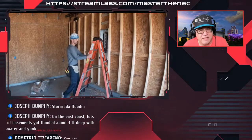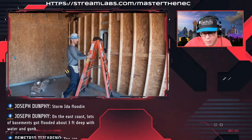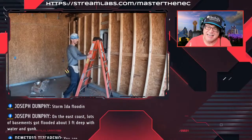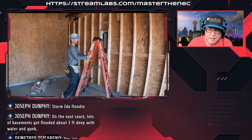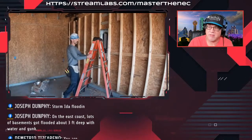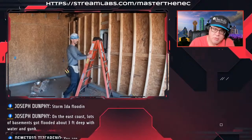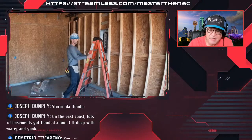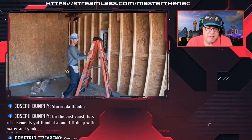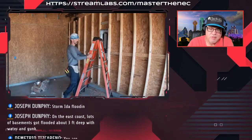So he does his first. I like to do mine last because personally, I like to get an idea, while I'm pulling the cables and doing the different rooms, of how I'm laying out my circuit and how many things are going to be on it before I run that home run. Because there are a lot of misconceptions in residential. You're going to hear people say that this jurisdiction only allows 10 receptacles on a 15-amp circuit and 12 on a 20. The reality is that in residential, it doesn't have a limitation, right?